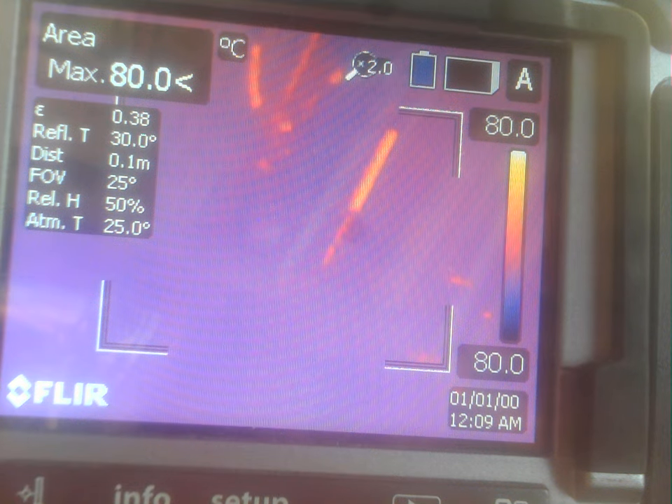This is test number one: 1.6 millimeter diameter copper wire being deposited on 951 as-fired LTCC from DuPont. We're spinning at 30,000 RPM, using an X-to-Z feed ratio of 80, which means 10 millimeters of track length to 0.125 millimeters of Z feed distance. I'm going to go ahead and start the spindle and start the deposition.